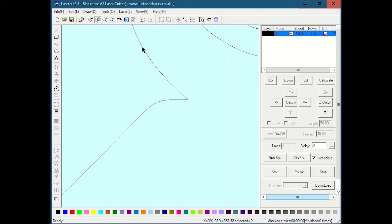So when it does that, it's going to inherently stop to change direction. So if I have a certain amount of power that's cutting, cutting, cutting, I stop here for a second, and then cut, cut, cut, you might get a little burn artifact because I'm essentially stopping with the same amount of power, so it's going to char it a little bit more. And if you look at a lot of the pieces on the rack, particularly pieces that are wood, and you look in sharp corners here, you might see a little bit of a char.